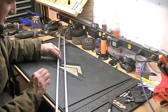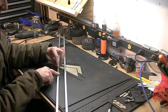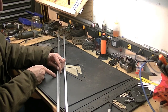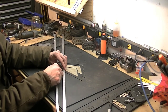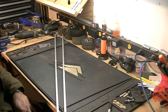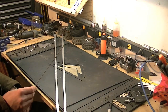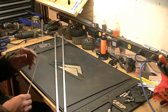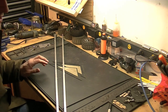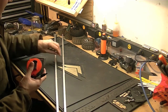So the first step to do this is to find my centers, and then measure out from the center the width of the stock, so that I can cut the slot on one side and cut the notch out on the other — that way they'll slip together. And then at that point I'll see if I'm going to try brazing it with some of this stuff and the torch. It's just kind of an aluminum brazing rod.